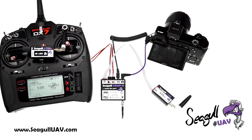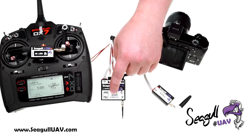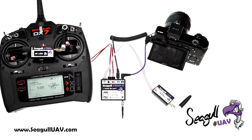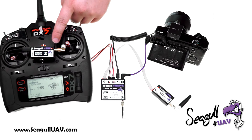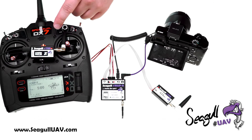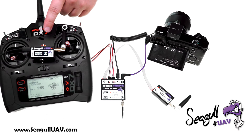The next warning we get on the TRX module says 'no lock', meaning we currently don't have a GPS fix and therefore no GPS lock. This is also shown on the MAP-X unit itself with the GPS lock LED not lit up. If we try to power on the camera and trigger a photo, we get a readout on the TRX saying 'camera failed' — meaning we don't have feedback from our hotshoe or we don't have a GPS fix. We see a switching between 'camera failed' and 'no lock', so we know what we are missing is the GPS lock.